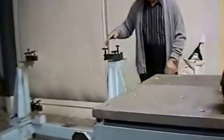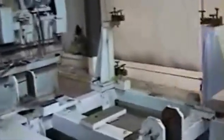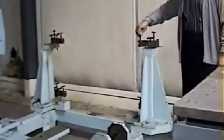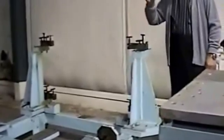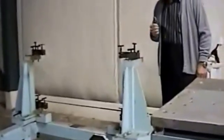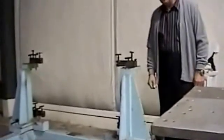Well, if you'd like to get the twist out, which you really shouldn't, you can step inside and it will straighten itself out. But you should not do that. A little twist will not hurt, because all the attach holes, the carry-through spots located here and there, and the attach holes for the engine mount, even if you have a little twist, the engine mount and the engine will be in the right place, and the spar and the wing will be in the right place.